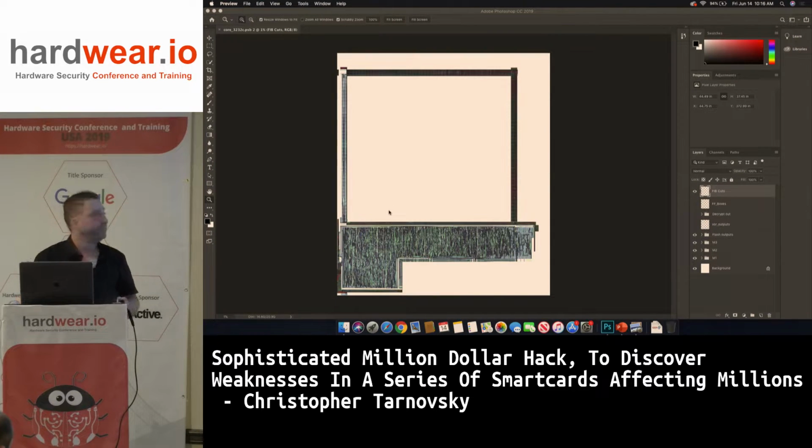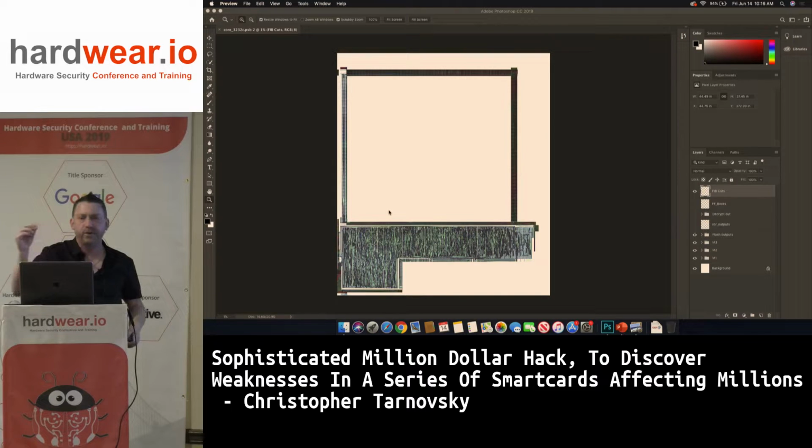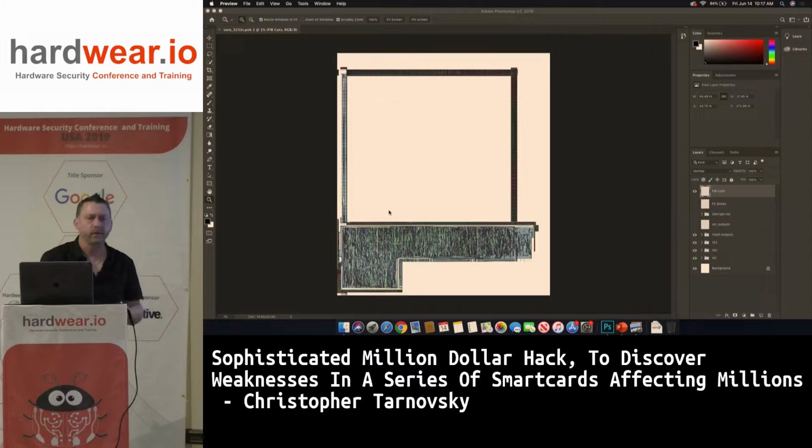So you can see here, the flash was right here. But I'm not going to image that flash because, like I told you, it all looks the same under the microscope at 100x, 150x. So the only thing I cared about was the flash outputs and the logic, which was here. And there was a static RAM here, I believe, or there was a ROM, but the ROM was for cryptography, for their math processor. All of these chips we're talking about have a math coprocessor inside. So they could do asymmetric crypto algorithms as well as symmetric. They have DES, RSA, elliptic curves in some cases.